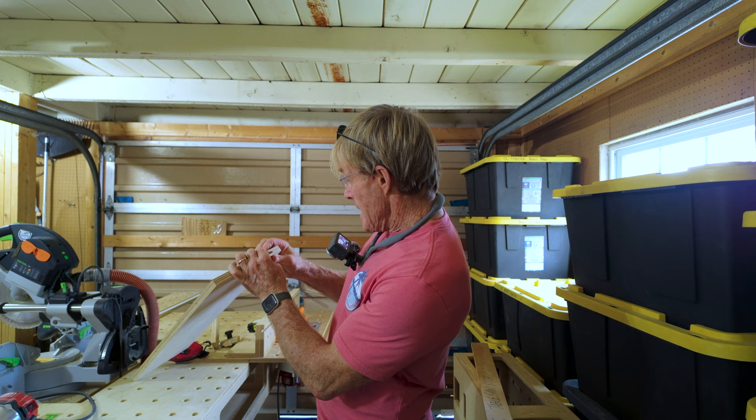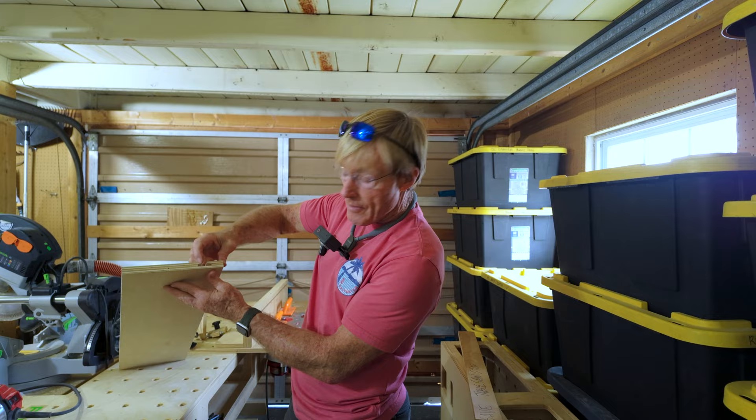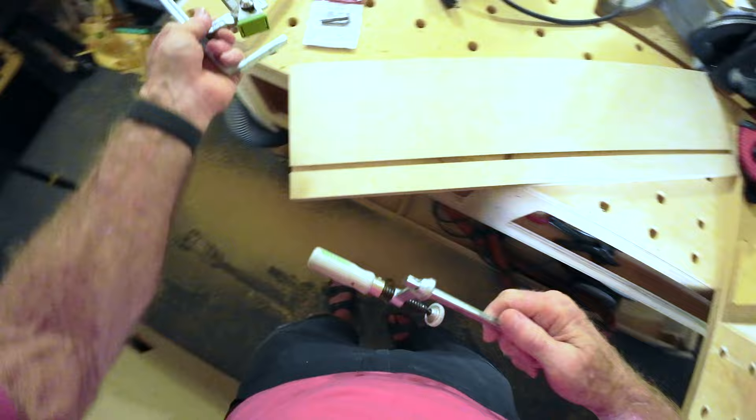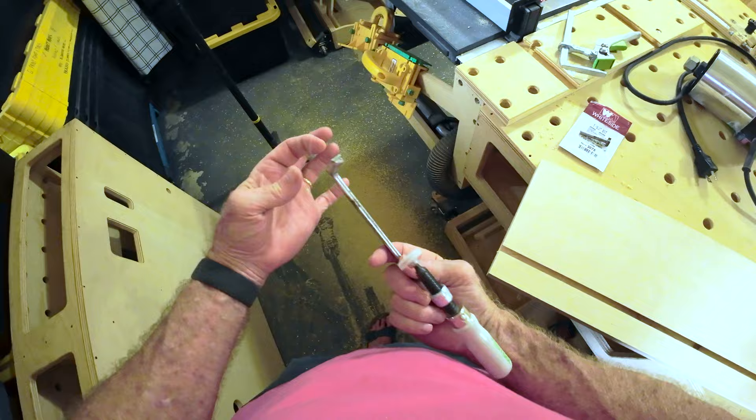It's in 18 mil — it's really strong. I left 6 mil on the top there for that lip because it's more of a cantilever. You can see it's got this 30-degree cut. Now I know why this is wider — they are designed to work with clamps. You can see these clamps have this angle on them, maybe 30 degrees, but it's definitely an angle. And they're wider than this, so you can see they won't fit in this T-track, but they will fit in the larger one.